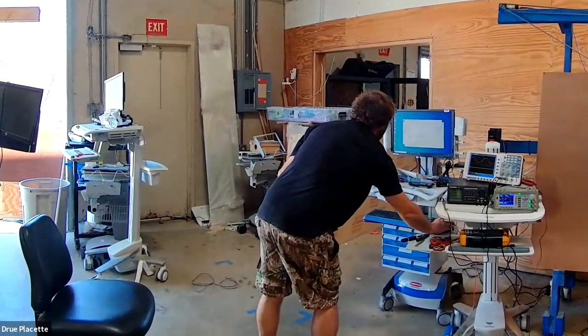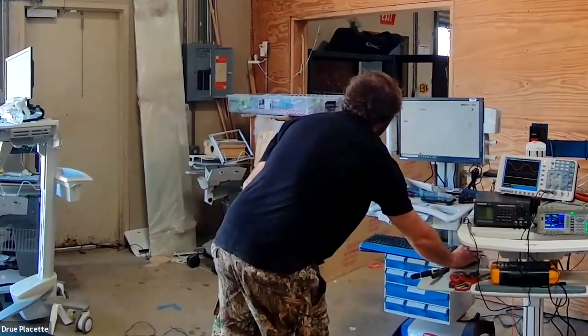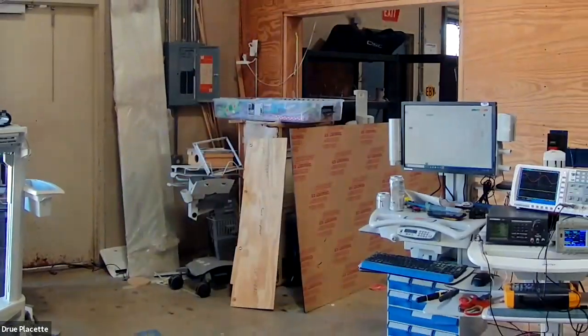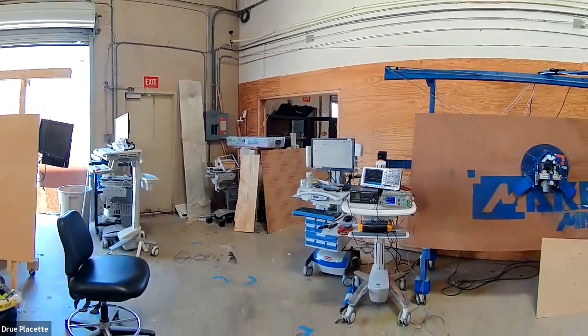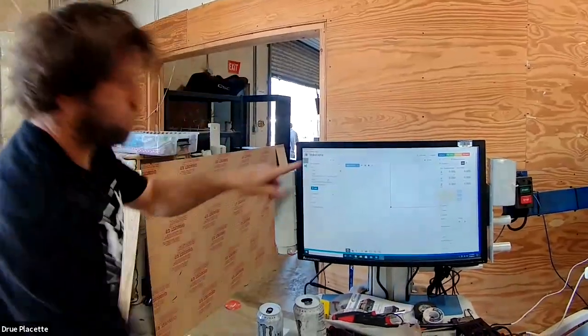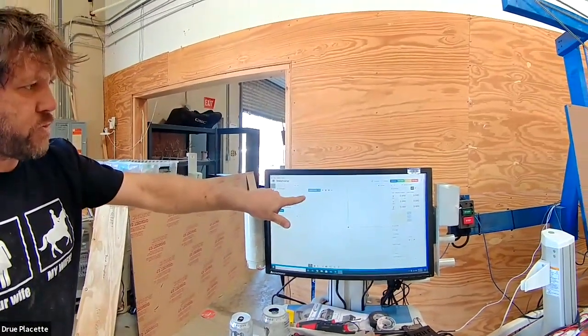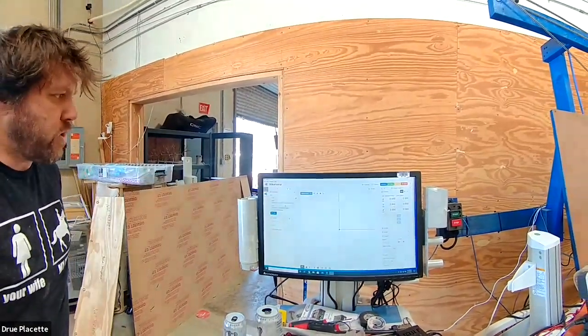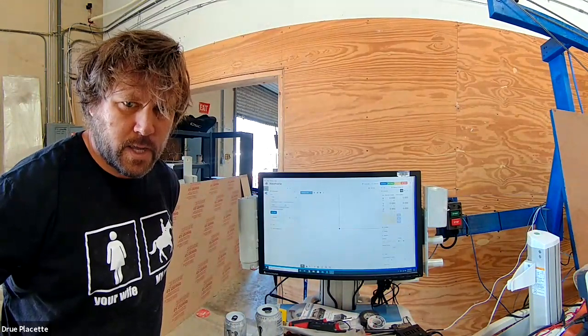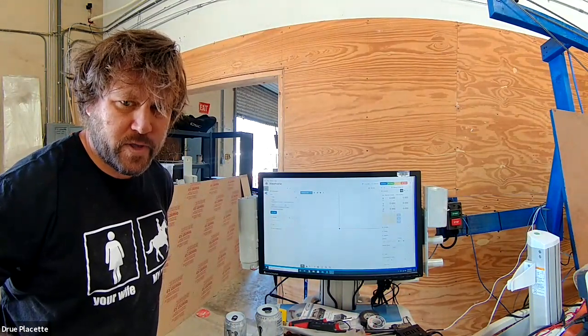Let me pull up Makerverse here. So when you go to Connect, going under connection, let me move the card. Under connection, when you open Makerverse, change your COM port to COM 4 right here. Yeah. And you can hit refresh too there, and that refresh will allow you to see what ports your computer is seeing.